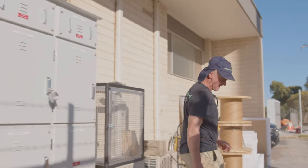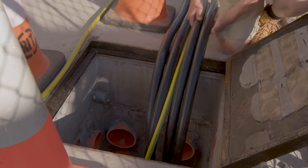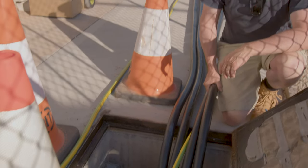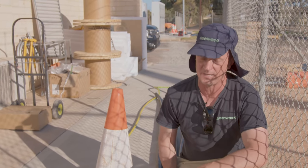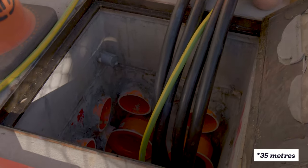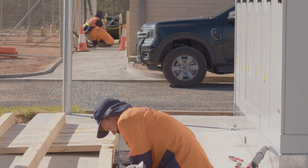Now let's have a look over here — we've got some fairly big cable. We've got the actives: red, white and blue; we've got 150mm earth and a neutral. This is again the 500mm squared aluminium flex. It's incredibly hard to manhandle — this cable is going on a flat straight run, 150mm conduit, 30 meters. That's a lot of cable in 150mm conduit, and we had to hand pull this.